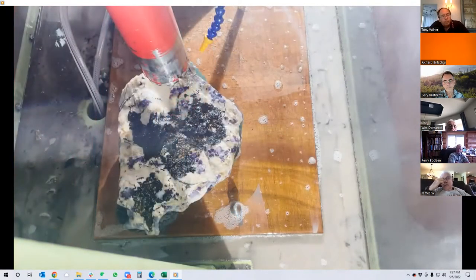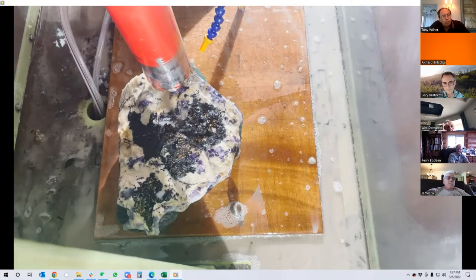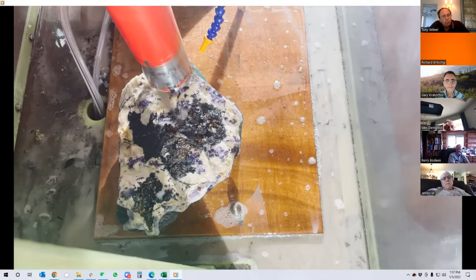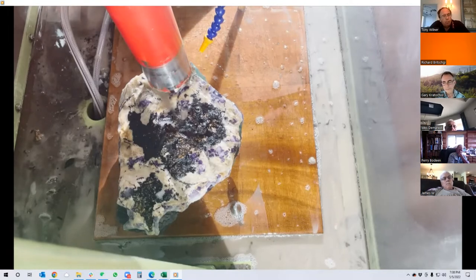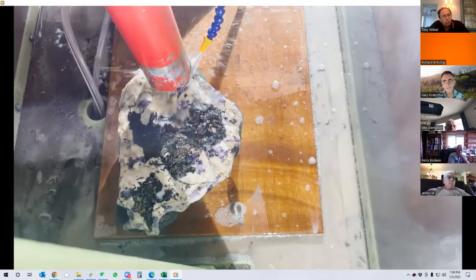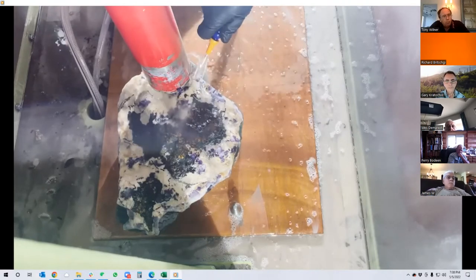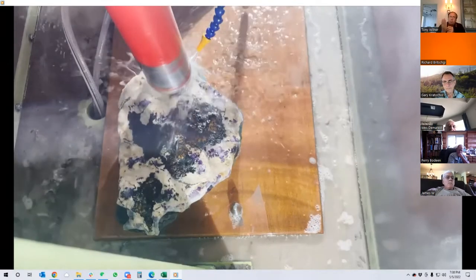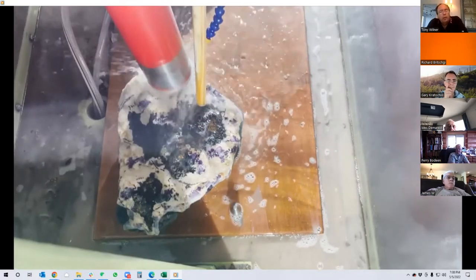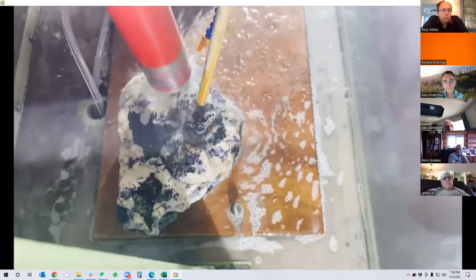With the rock in place, the safety shields on, safety equipment on, let's lower this core bit down. I use the rapid feed to get down to the proximity, and then the micro feed helps us go down. I'll get a little closer. That looks good. Get the oil going. Good. Drill. I like using dowel just in case. This is such a big piece of rock, it's really stable. It shouldn't go anywhere, but I like to have it just in case.